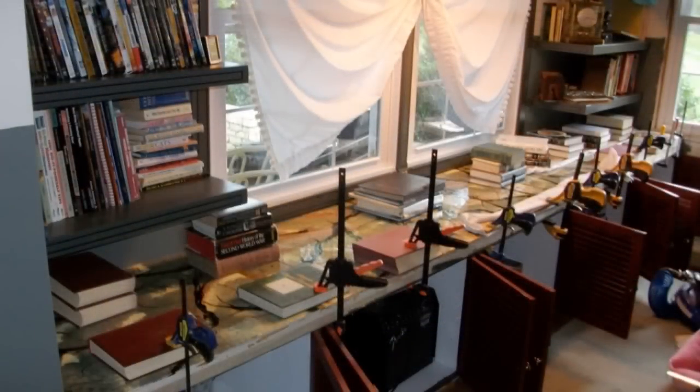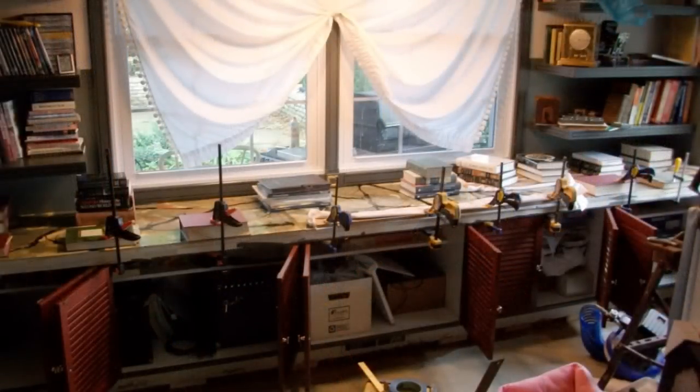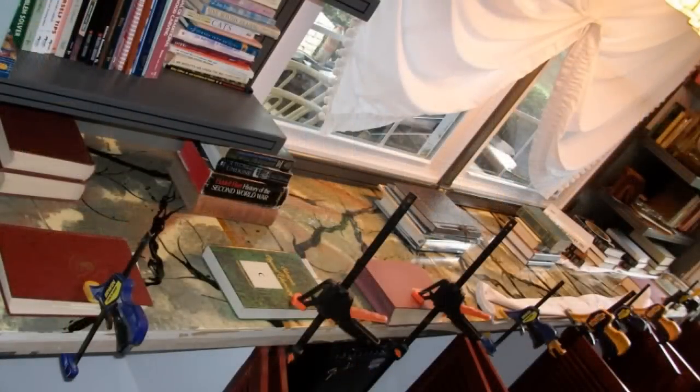I used standard liquid nail structural adhesive to attach the panels to the original surface, holding it in front with clamps and books in the back. I did shoot some pin nails around the back edges. The books and clamps left some marks in the finish, which for the most part flowed back out.